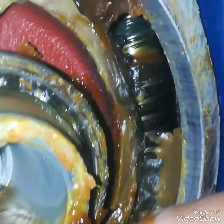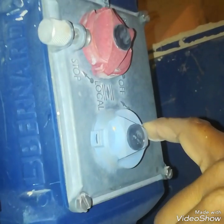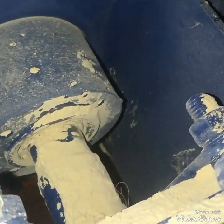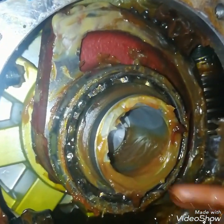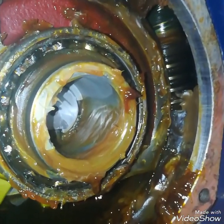As you can see, the safety bolts for over-travel — mechanical bolts — are fitted. Now I am starting the actuator. It is running on local. You can see I have pressed the local selector and it is moving. The grease is not okay. I will clean it and then refill with new grease, then we will check if the sound is okay or not.